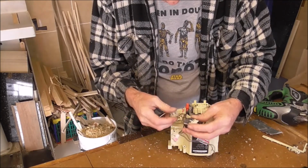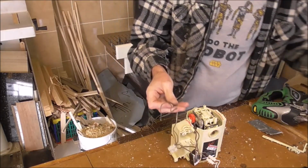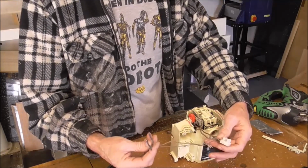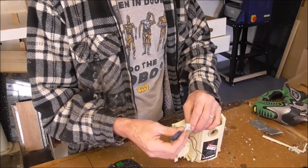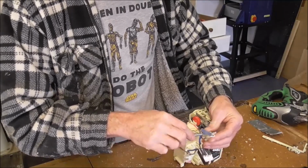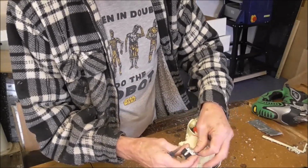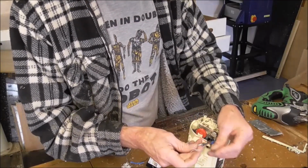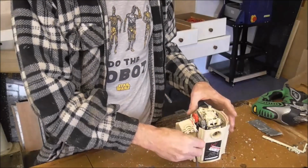That I need, the suppressor, I need that. Onto the live neutral in. That's for the LED, which I can have if I want, but I don't need it. It's that switch. So if I was to take that off there, put the suppressor in and connect it to that, that should give me a straight run. If I'm not mistaken, I should be able to connect the live cable straight to that. That should connect straight in. You don't think I want it later. Right, so I'm going to test that first.